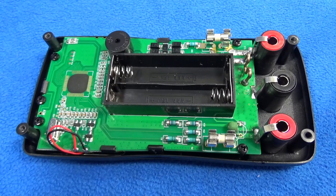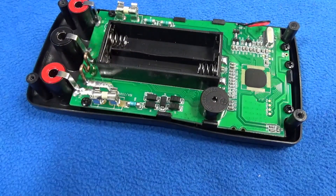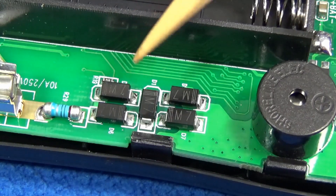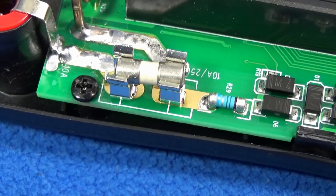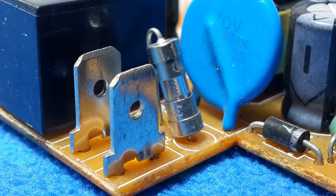This is what the multimeter looks like inside, with open-gap banana female connectors, a voltage chopper with bridge rectifier. The fuse is small, but I will not criticize about it. Why? Because those kinds of devices are getting fashionable, so probably I will have to get them. I already have other devices and I did other repairs where those small fuses came inside.